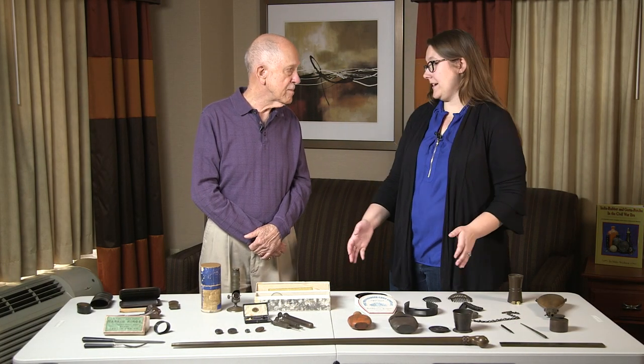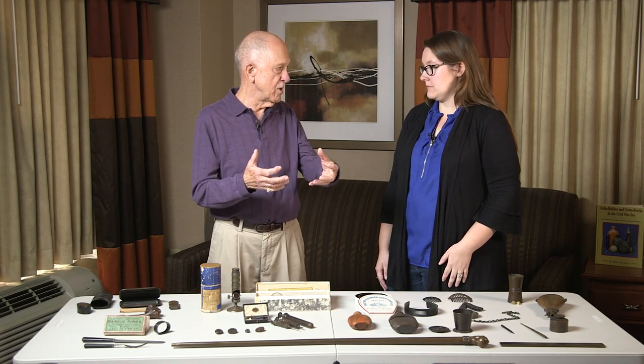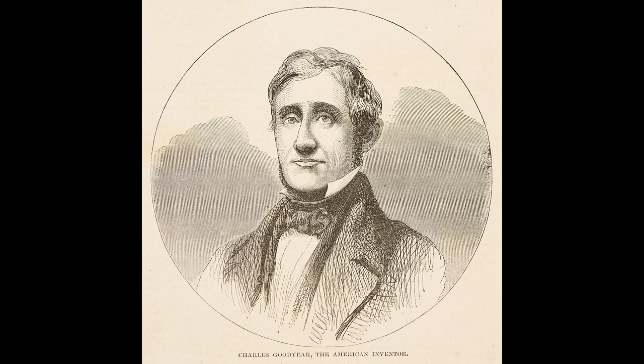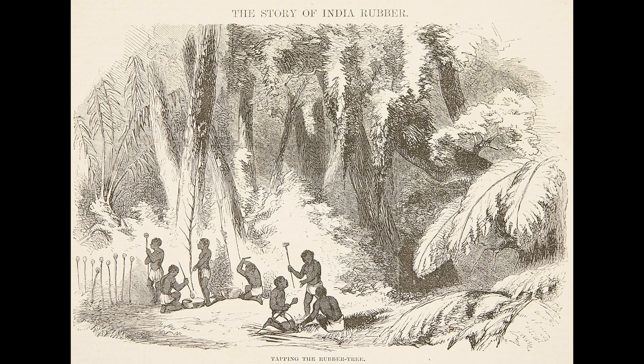So hard rubber is vulcanized, you've said. What is vulcanization? Good question. When we talk about vulcanization of rubber that Charles Goodyear discovered and patented in 1844, and Thomas Hancock in England, that's basically taking this rubber latex material, which is unstable — gets soft and sticky in the summer, hard and brittle in the winter. It's coming from the hevea tree in South America, though it could come from any one of hundreds of trees of that type. It's basically taking that and combining it with sulfur, some metallic compounds, and then subjecting that to heat. That creates a chemical change in the rubber itself that makes it flexible through any temperature. When we talk about hard rubber, you're taking that same rubber material in sheets but adding more sulfur to the mixture, and the more sulfur you add, the harder the rubber.